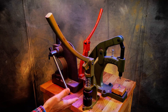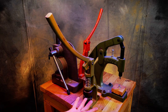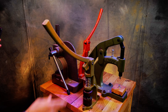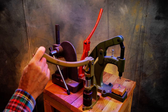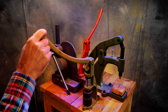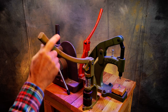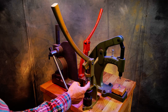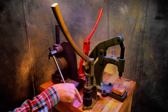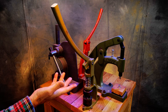The pin changes out relatively easily, so now you can use dies for whatever pin you have inserted into whichever press you have. In that regard they are interchangeable — you just have to change the pin to match the dies you want to use. If you find this stuff secondhand you can get into it affordably; get a Handy Junior or CS Osborne cheap and change out the pin for around $25 to $35. Check the description for a part number to help find a good dealer.